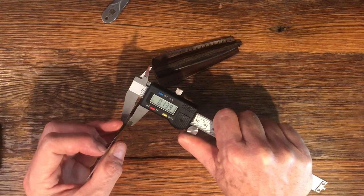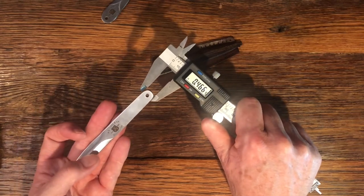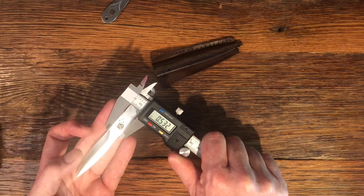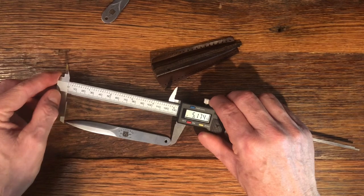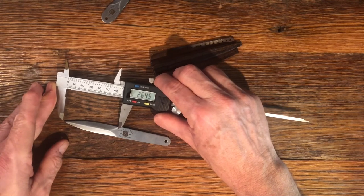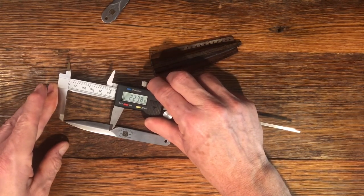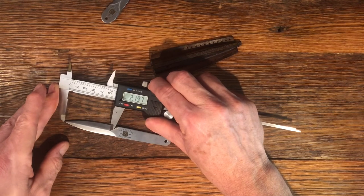The large dagger thickness is 0.139 inches. At the end it is 0.46, and it tapers up to 0.53 where the blade starts. Overall length is 5.17 inches. The blade to where it starts to taper is 2.5 inches, and from that point to the tip is 2.19 inches.